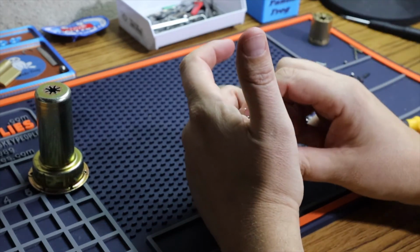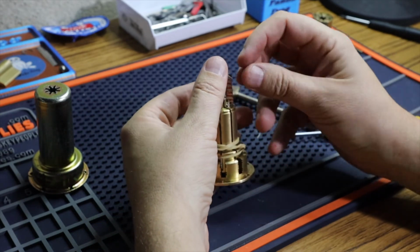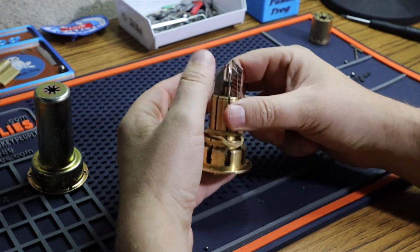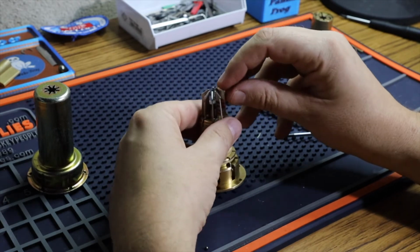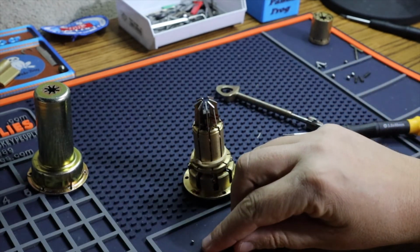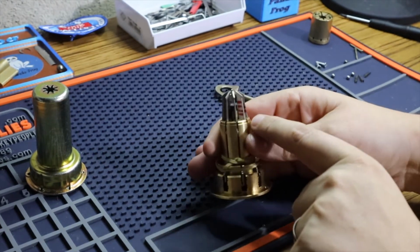Still in there. Okay, doesn't matter. All right, now you can see I already lost the ball bearing there. Now I make sure that I can push every wafer a little farther out behind the line like this. And this is how I reassemble it also. Already have one ball bearing here. Just dropped out somewhere. I marked all the wafers so I know where they go back.